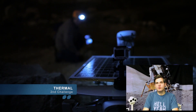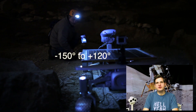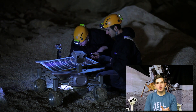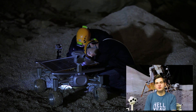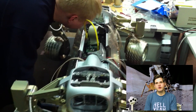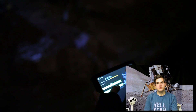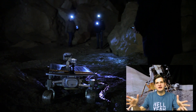The second thing you need to watch out for is the thermal environment. It can get really hot and really cold on the moon — we are talking about temperature shifts from minus 150 to plus 100 degrees Celsius, a shift of over 200 degrees Celsius. The challenge is to build a rover which can withstand these temperatures. In our case, our rover called Asimov only has to operate during the lunar daytime, so it only has to deal with the immense heat. But the problem is it's a modern rover with all kinds of fancy electronics, and this level of electronics produces a lot of heat. Solving this on Earth is quite easy — you would use an air ventilation system — but the moon has no atmosphere, there is no air and no easy way to cool things. The best solution we came up with was using something similar to heat pipes to transport the heat away from the electronics and radiate it outside of the system.